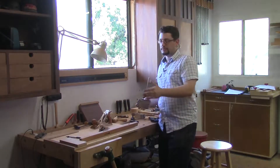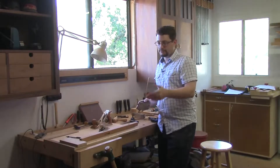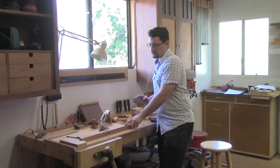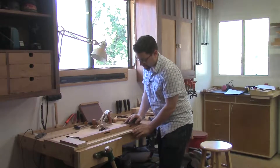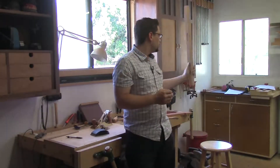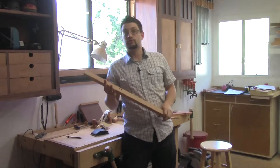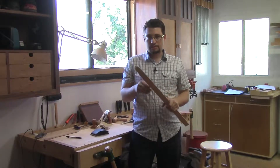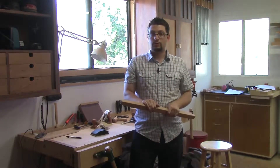There's a different look between something that's been sanded and something that's been planed when you put finish on it, so I want to make sure all the surfaces here have been sanded. This front leg is done. I'm going to set it onto my table in the back that has a rubbery surface on it and set it aside until I'm ready to dry fit and glue up the front of the chair.